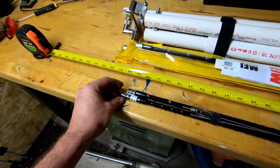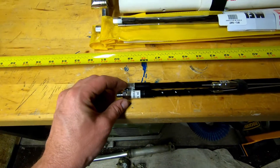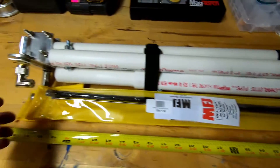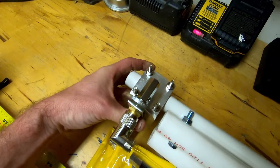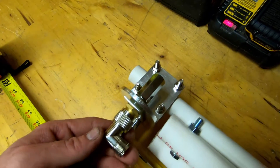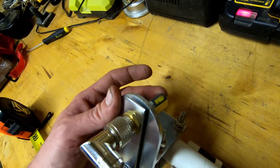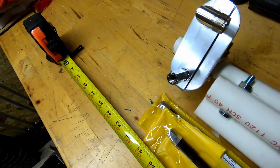The antenna is made up of two hamsticks. You can buy them individually — I bought mine from DX Engineering. I'll leave links to all the parts I used in the description below. I've got two 20 meter hamsticks and two 40 meter hamsticks that I have yet to unpackage and tune. This is the magic piece — the hamstick dipole adapter. As you can see, it's built basically just to clamp onto a regular mast. I put a 90 degree coax connector so the cord can just dangle down. This piece connects to the center conductor of the coax, and the shield side comes out through here to form your dipole out of two hamsticks.